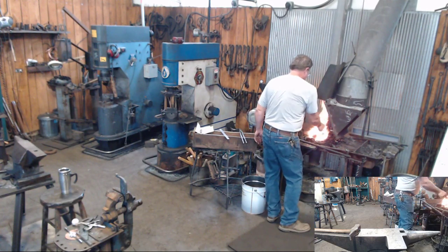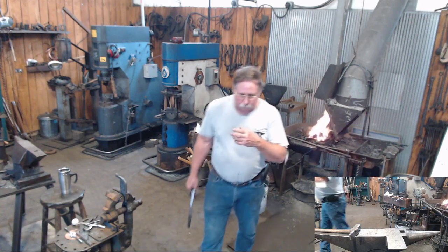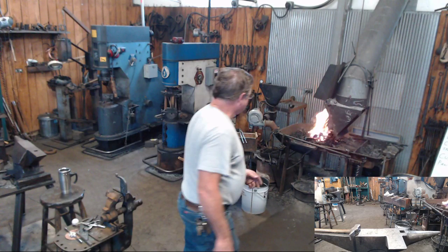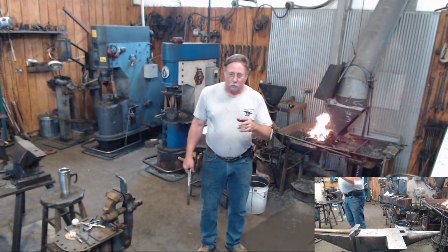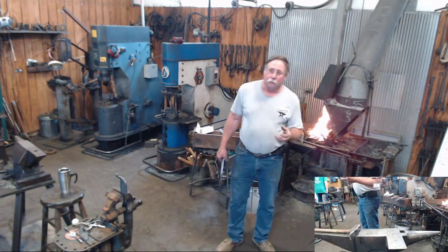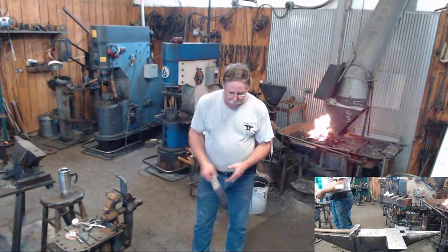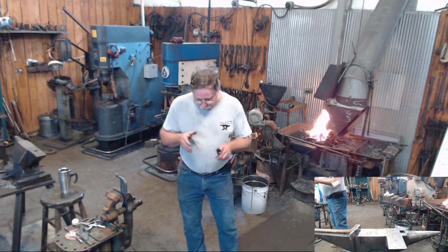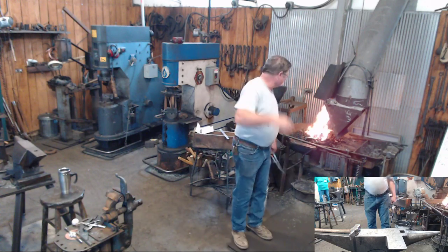Now, as you can see on this piece, these legs are very plain. We've just forged them out and formed them. Just like there were different ways to make a three-legged base, you can get as decorative with them as you like. I've made bases with a long taper with a ball on the end of it that I've domed out a little bit.